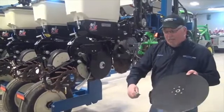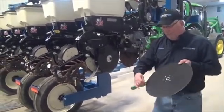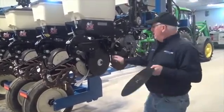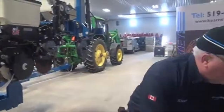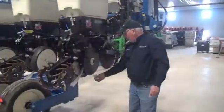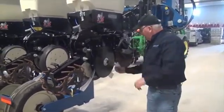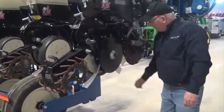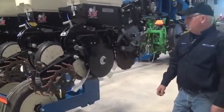A good trick is that there's always paint on a new blade — make sure you take your utility knife and scrape that off. We do every single blade here at our facility. When you mount it back on it will be metal to metal. The way we check our blade closure is to simply take two pieces of paper. Ensure that you're not using a playing card or a business card — it has to be paper, everything else is too thick. Put it between the blades. You want an inch to an inch and a half of contact. As you can see, this blade is adjusted perfectly.